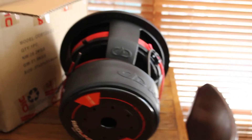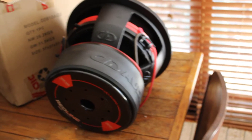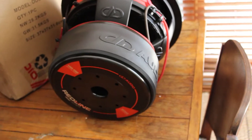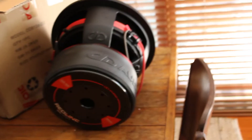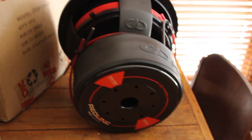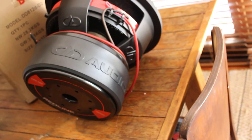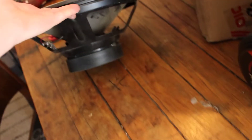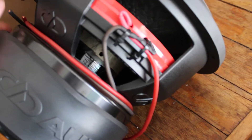I don't really know what to do — it's the most powerful amp I've got. I'll only put 600 watts into it, but still, that's 600 watts free. I suppose I could wire it to one ohm and it'd rate at around 2400 watts, as long as the box impedance rises to four ohm. It's going in the horn. This should give me a good bit of power handling — the old driver I had was more like that one. More power handling, shouldn't burn up. Should be able to run it at 600 watts for the whole night without thermal issues.